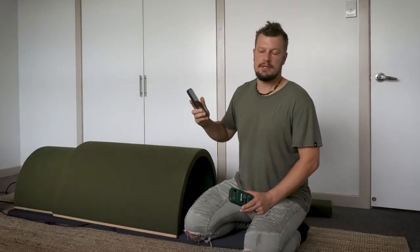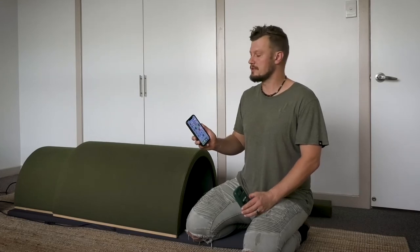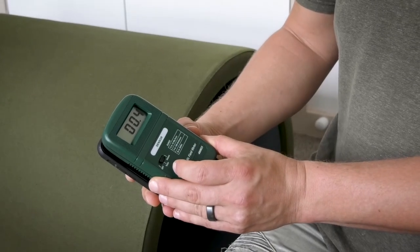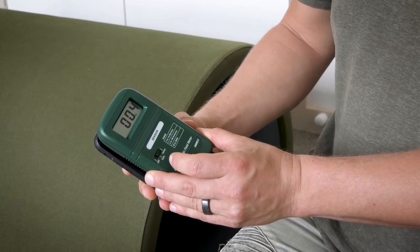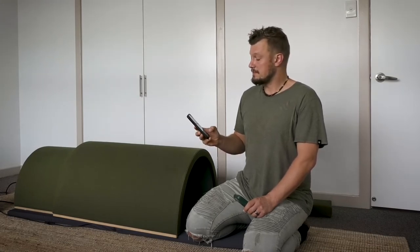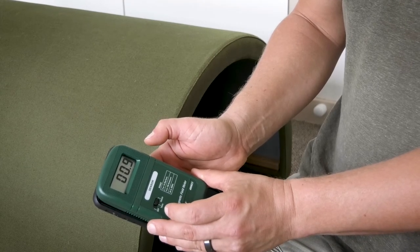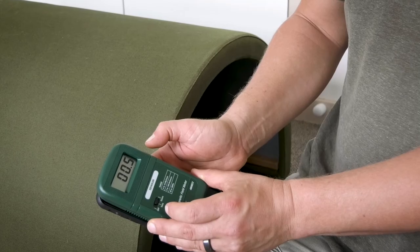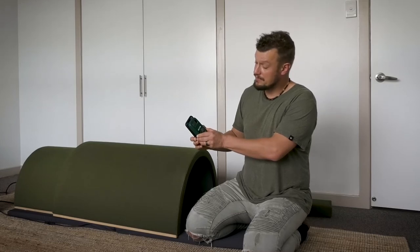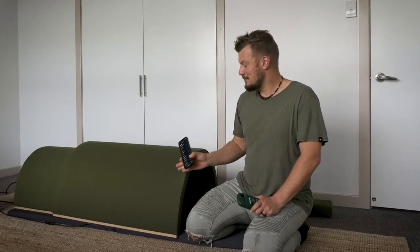I will also give you a comparison of what an iPhone reads — a fairly new iPhone. There is a huge difference depending on what you are actually doing with the phone. Connected to Wi-Fi and not on a call, just on standby, I get 0.2 to 0.3 milligauss — still in the range considered safe by the World Health Organization. Now I will call a number. The moment it connects, that jumps up to 0.5, sometimes 0.8 — and it can go as far as 5.0. So the phone certainly has more EMF than the dome.